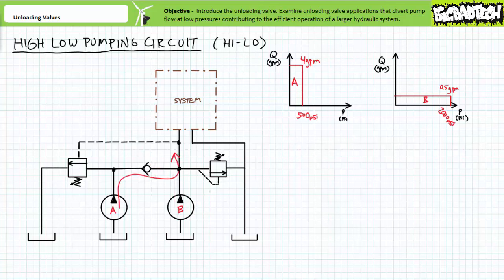The pump charges the accumulator up to 1,000 PSI; the differential unloading relief valve then unloads the pump at low pressure and keeps it unloaded until pressure in the accumulator drops below 850 PSI, at which time the pump recharges — keeping the accumulator inside a differential range of 1,000 to 850 PSI. The magnitude of this differential range is a byproduct of the fixed area differential between the second and first pilot dart; only the fully charged value is adjustable. If the second pilot dart is 15% bigger, there's a 15% differential; if 30% bigger, a 30% differential — in this scenario 15%, but a 30% differential would result in the accumulator operating between 1,000 and 700 PSI.